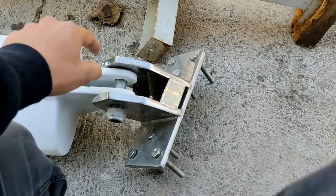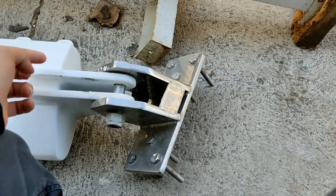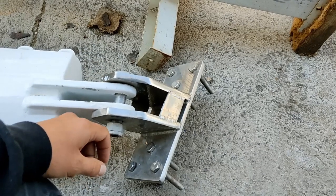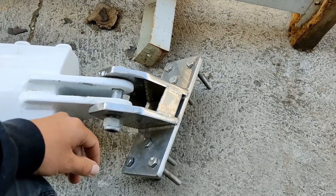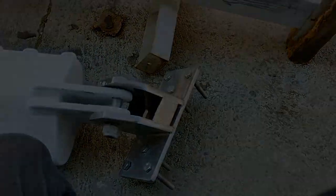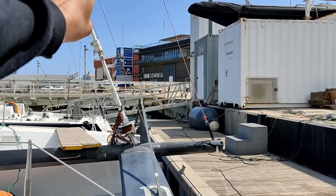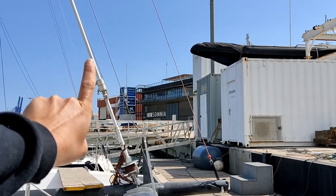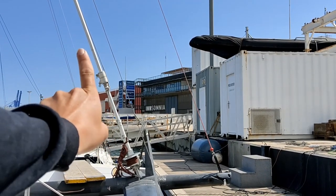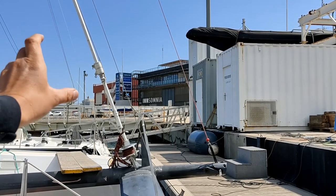That flexibility — and how we deal with the whole torque issue through the beam — is one of the things we'll talk about with the new arrangement, because the beam now becomes a very structural member of the boat. The load of the forestay is not directly vertical straight up and down — it is actually pulling backwards a bit. This is a very important and critical thing to look at with the beams and the loads it applies.